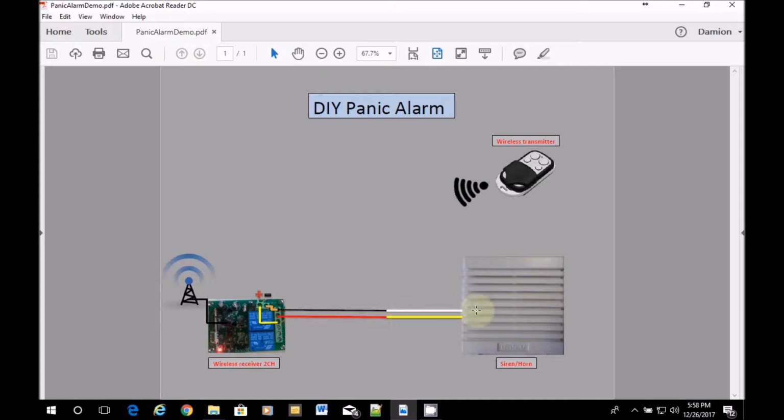So now we attach our horn. The horn comes in, yellow wire, which I've chosen, goes on the positive side and comes in to port B. And on the negative side, the white wire comes in to the negative terminal, which, using the jumper, will go across the negative. That way there's a circuit being made. The flow is going to go here, go into here, give this power to make noise, and go back out like this, and back out to the power. So that's a circuit being made right there. You can use either side or you can use both channels. Just remember, negative to C, positive to A, and your device is going to come in positive to B, negative to A. Also on this board there are 3 pins in this general area right here.